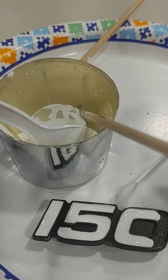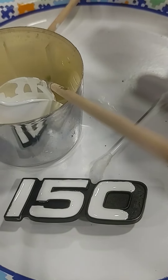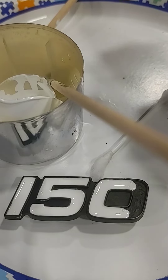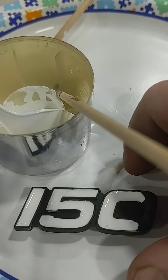It's semi-gloss, but people can't really tell semi from gloss if we're talking latex. Normally, 15 minutes after you roll or brush it, you can touch it. They used it a lot in hospitals on the walls so gurneys would bump the walls and it wouldn't peel. I see a little imperfections on my paint brushing, but straight on I really can't see it. It's okay to build it up because it doesn't shrink and crack.